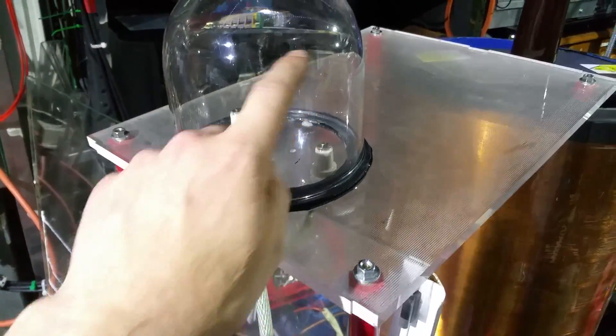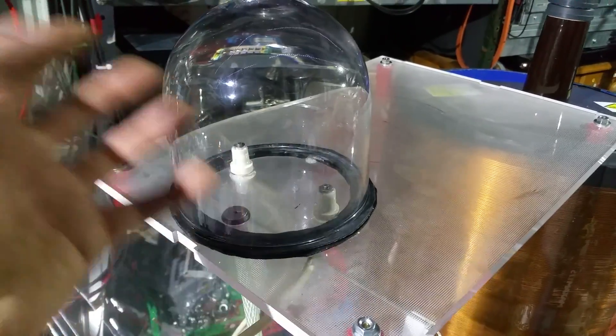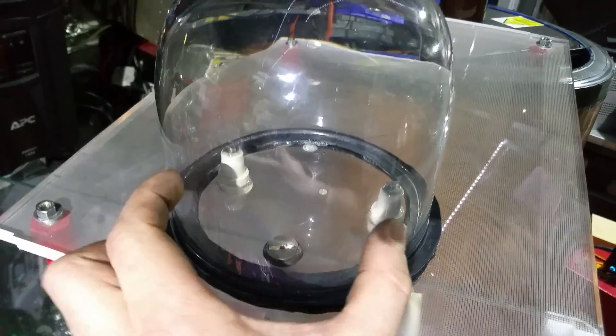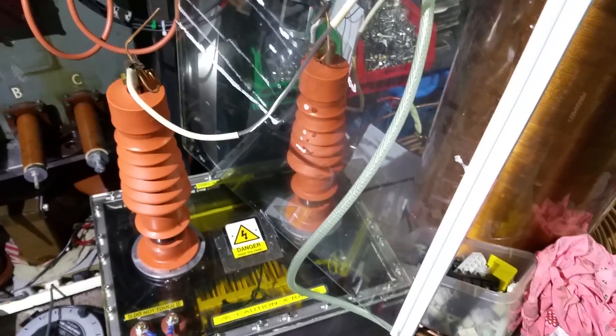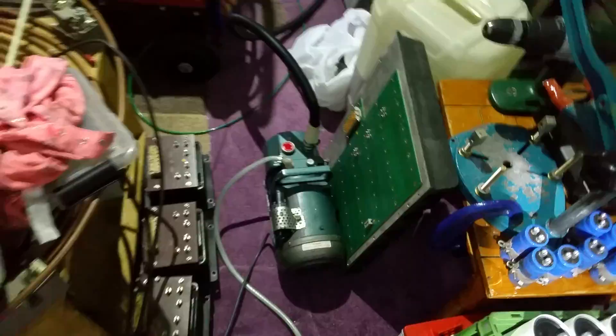Right, look at this! I made this from some sort of Christmas decoration — it had little houses in it — and it was on a ceramic base. I broke the ceramic base off. It's like a ceramic pot, the same thing tomato paste comes in. It's got a nice little breather for the vacuum and two electrodes. There's a bit of vacuum in there already. I've got it hooked up to my 150 kV X-ray transformer, running it off a ZVS driver.